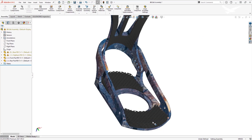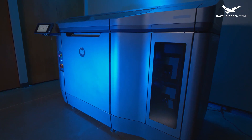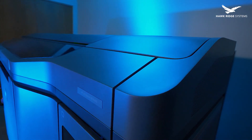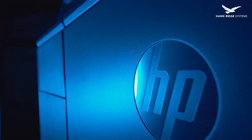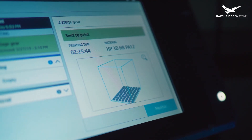After we had the material we wanted to print our parts from and had the geometry we wanted, it was time to print our parts. TPA from Evonik is designed to be printed with the HP 4200. This industrial series printer offers many features including removable build units, fast cooling options, and an external post-processing station to accelerate the printing process. These build units also enable the machine to swap materials as needed, giving the 4200 a larger material portfolio including elastomers and also the ability for higher throughput, which makes it perfect for our application.